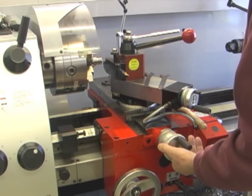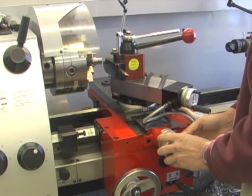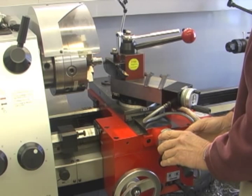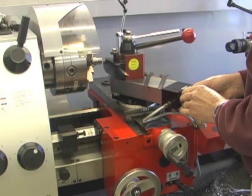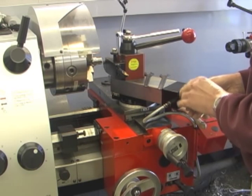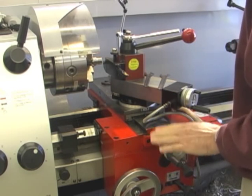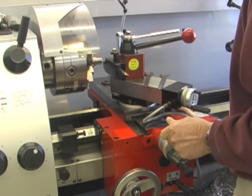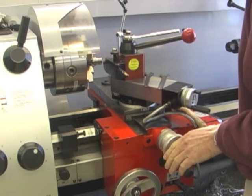What I did there was wind out and pull out my cross slide as well. I move this to zero, then increase my depth of cut on my compound a little bit, and then I start again — bearing in mind I'm keeping this ready to remove the cross slide from the thread path and at the same time to reverse the direction.